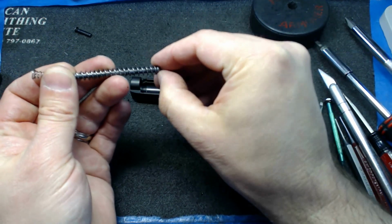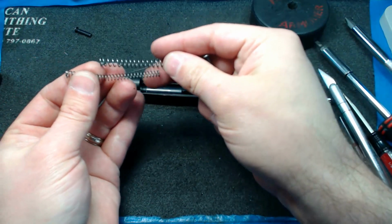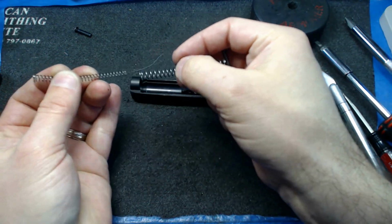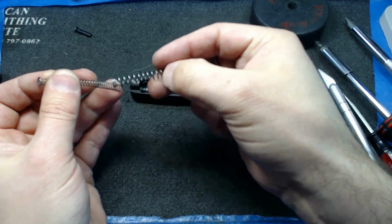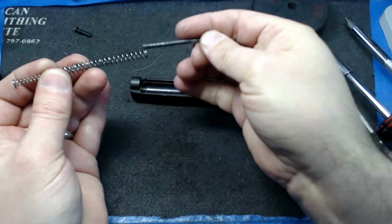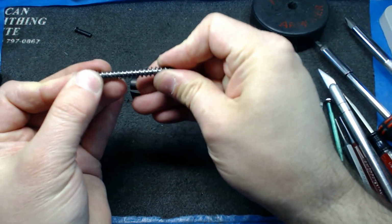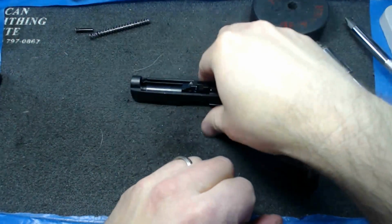An important thing if you're building spring things is that if you need a double coil spring, you always use coil springs wound in opposite directions. If they were wound in the same direction, they would tend to bind. Now I just lock them together. They would tend to bind when they compressed. If they are coiled in opposite directions, that just can't happen. So they just slide past each other. Anywho,